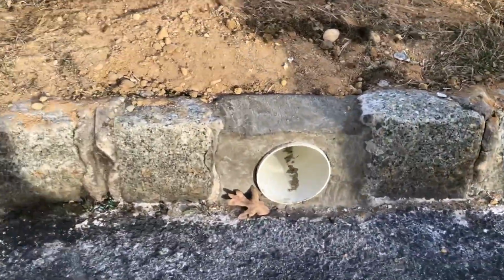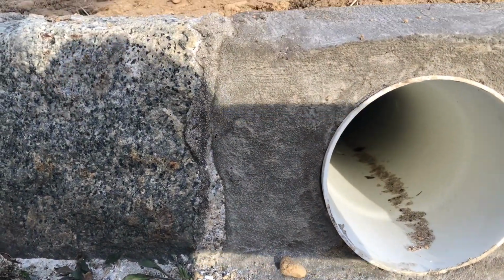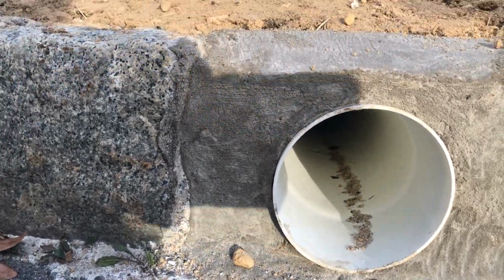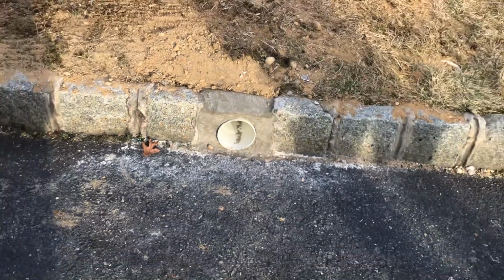Since before, like I said, I couldn't put a catch basin or anything, so if you can see, I got perforated on the last little section, and then I have rock under it, so it's almost like its own little mini dry well. Now we just have to wait for it to build up and come out at the end.